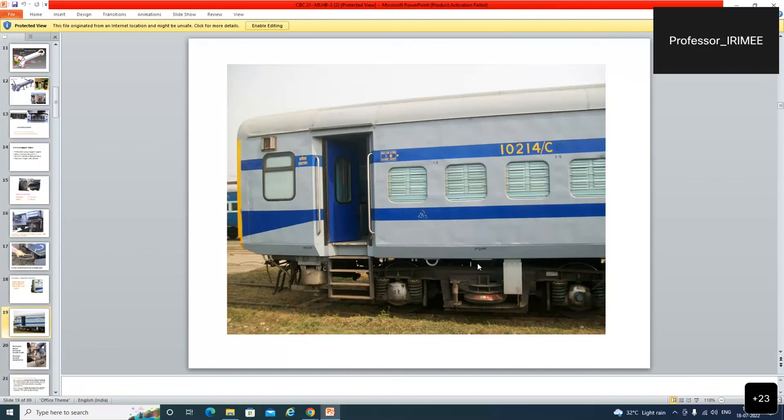When Mamata Didi was the rail minister, people of Bengal wanted to travel in LHB rakes. The first LHB rake was running between Lucknow and Delhi. They also wanted a rake from Kolkata to Delhi. For that purpose, our workshop, RCF, was unable to produce such a huge number of bogies. They told the minister, we shall make the coaches, but certain alterations are to be made with the ICF bogie, and this hybrid coach can fulfill the desire. They all agreed because the public has to get comfort and has no concern with the bogie. So this is a hybrid coach.